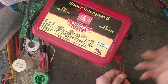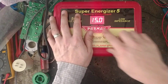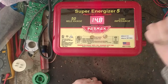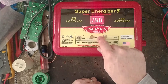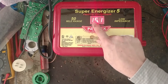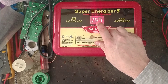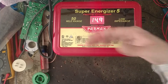If the number goes way up high after you unhook everything, it usually means your fence is the issue. These numbers will change on the fly — if it stays up nice and high with nothing hooked up and then drops when you connect the fence, typically the fence has the problem. If it stays down low with nothing hooked up, the unit has an issue, because it should read about 12, 13, or higher — maybe 16 on the high side. Don't put too much faith in the exact number; it's kind of a quick-glance thing — high number means fine, lower number means there's an issue somewhere.